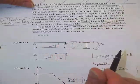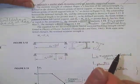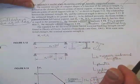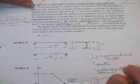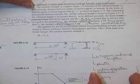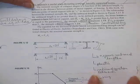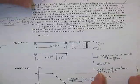L sub B. That's you. In other words, you go and you look at a beam and you say, I like that beam. I think I'll try that beam. That beam has an L sub B when you build it. There are some breakpoint L's that tell you what the beam is after you build it, whether it is going to be a plastic beam, an elastoplastic beam, or a slender elastic beam.